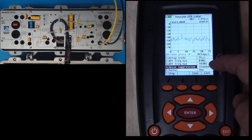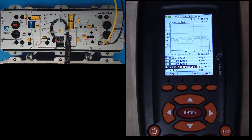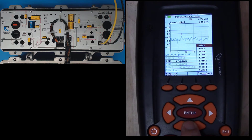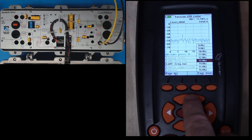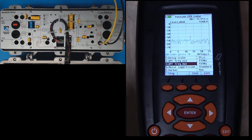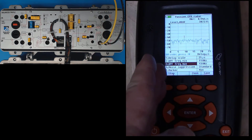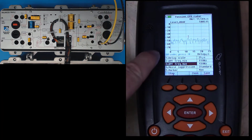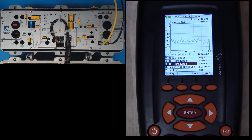The first tool I would use is the band pass filter. This would narrow the band pass filter if there are signals close to 12 megahertz — 12 megahertz is the frequency we're very interested in for looking at CPD. I'm going to change the lower side of that band pass filter from 8 megahertz to 11 megahertz, and the upper side from 16 megahertz to 13 megahertz. That now allows me to see from 11 to 13 megahertz — much narrower. If there were signals on the upper or lower side of that band pass, it would be filtering them out.